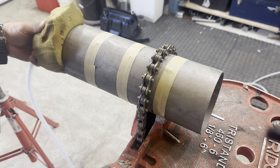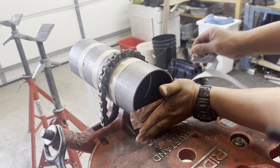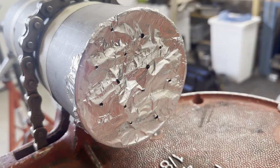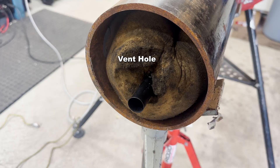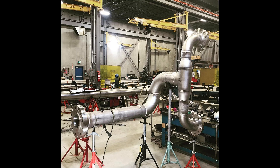Insert the purge inlet line to one side. Seal the other side with tape and make vent holes. You can also use foam to vent that side instead of tape. Inside the pipe is purged with argon gas as the air escapes through the vent. Key point: the purge line is low and the vent is high.